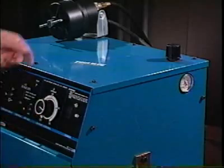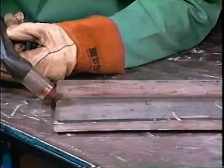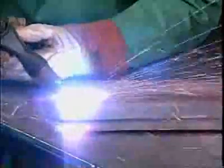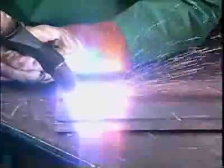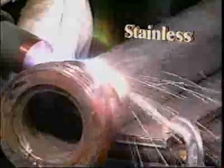Set the power source and air controls to the recommended position. Start the arc and proceed to gouge with the torch tilted at 40 to 45 degrees to the workpiece. Holding the torch at that angle, push the torch into the gouged area while blowing material out of the gouge. Just as with cutting, any electrically conductive material can be easily gouged.